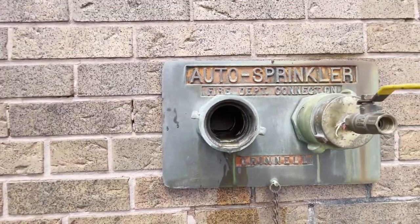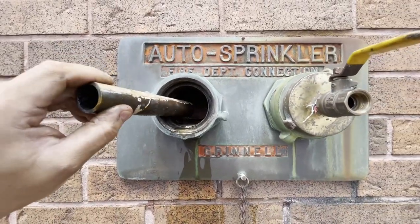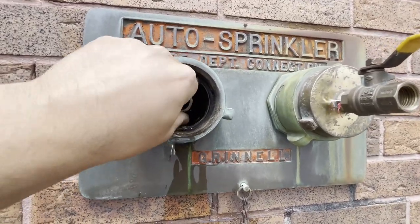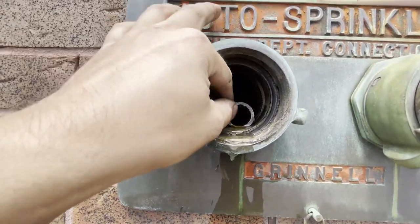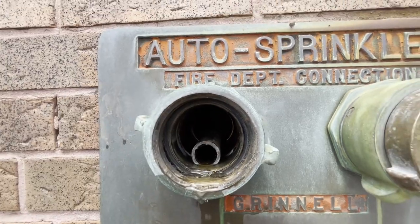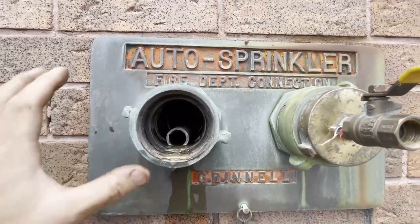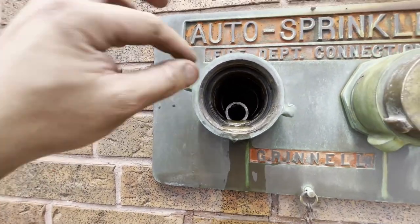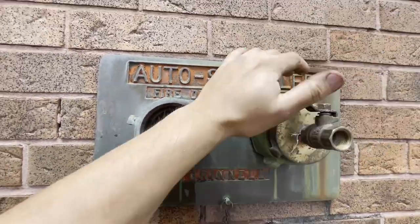When I do tests on pump heads like this, I cut a piece of pipe and stick my tape measure in there first because I don't know how deep it goes. I want to make sure whatever I put in there isn't going to get lost inside — otherwise I've just caused a problem. I stick something in there because I want to push that check valve open. I want pressure to reach all ends of this piping system, which is normally under atmospheric pressure.